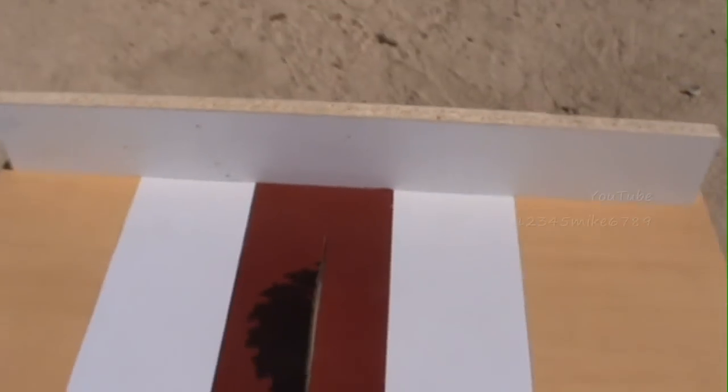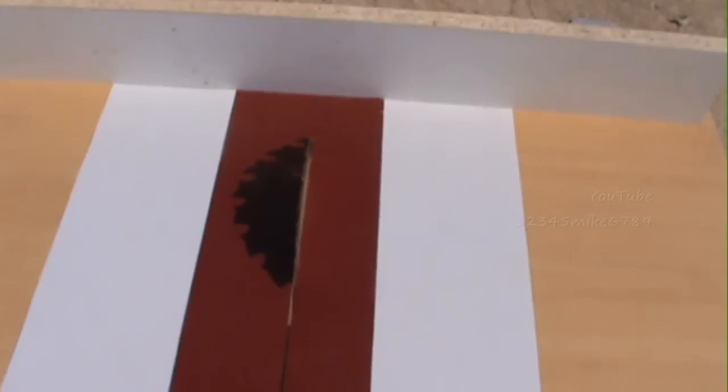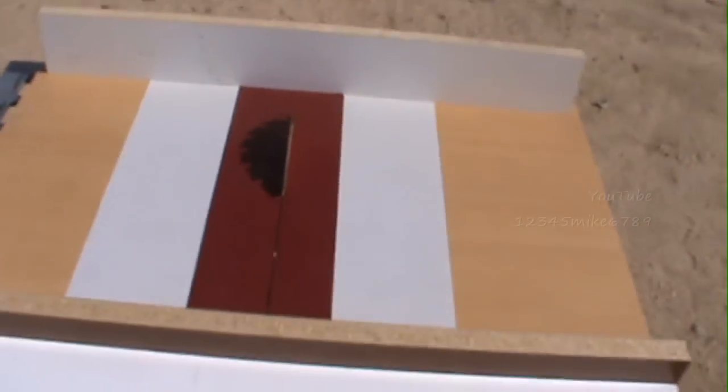Alright, I cut this piece down to 3 inches, and that's going to sit here. I'm going to screw that in with 2-inch screws. That way I can back this up at its full height of 1.25 inches, which I'm going to bring here, and I'll still have the support of the whole jig itself. Let's do that. Okay, here I'm going to use 2-inch screws, secure from the bottom up, and I don't have to countersink it because the 2-inch screw is just going to sit flush. I'll suck it up. Okay, so this is the bottom of the jig. Got the 2-inch screw sucked up, and it's not important that this has to be square. You just hold it about a 1/16 in. That should be alright.